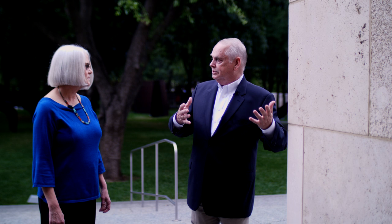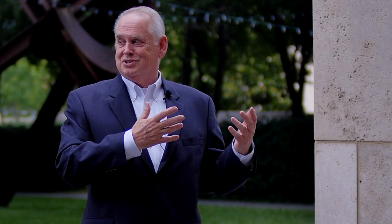All these different pieces get the quirk miter, which is a 45-degree glued-up joint on the corner, giving the illusion of a giant piece of stone. We couldn't do it as a single piece because behind this wall you have structural steel, the channels for anchorage, downspouts for water, electrical lines, and a series of other things all hidden inside. The Romans never had those things, so it was easy for them to stack block — we had to do something a little different.